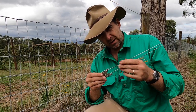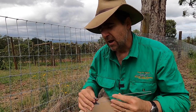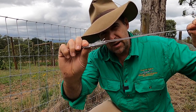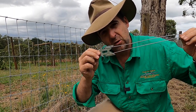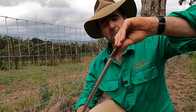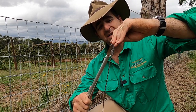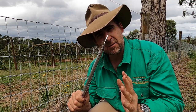There was a bit of learning I had to do in using these ground anchors. For such a simple tool there are a couple of big no-no's. The first is don't ever try to put them in the ground without bending the wire onto them properly first, because they will always jam on the applicator. The other thing I learnt was with the applicator — don't load it with the valley to the top; instead flip it around and load it from underneath. It just works so much better and is so much more reliable.